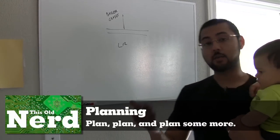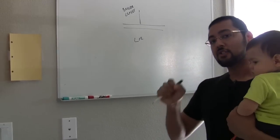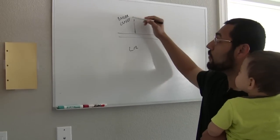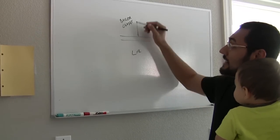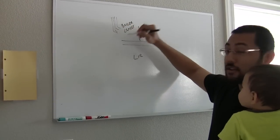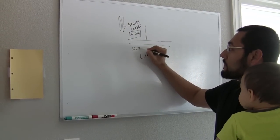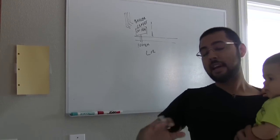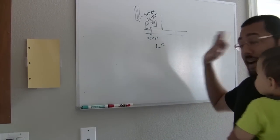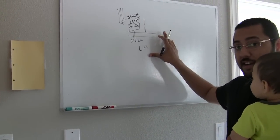We had to plan our home network. It's a lot easier in this case because the wiring is already in the house — we just have to convert it over and change wall plates. We had to figure out how to connect our router to where all the wires are. Everything seems to go really close to the boiler closet in our house. Our living room is nearby, so we have all the wires coming into the boiler closet into a switch, and then we connect the switch to our router over in the living room. If you have to plan everything from scratch, do yourself a favor and plan it all out before you start doing anything.